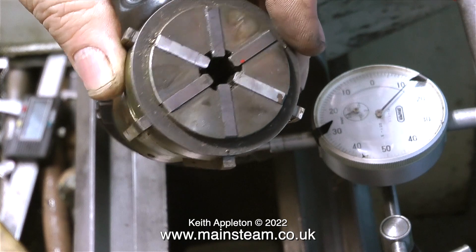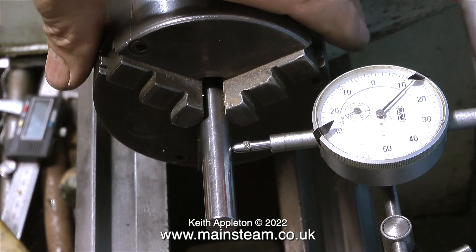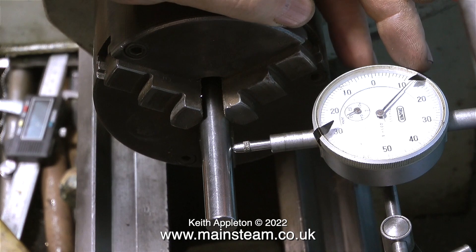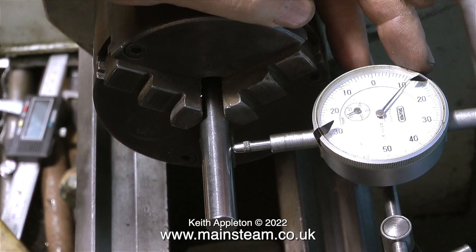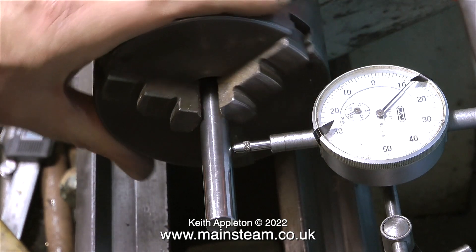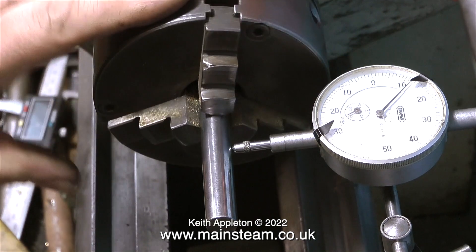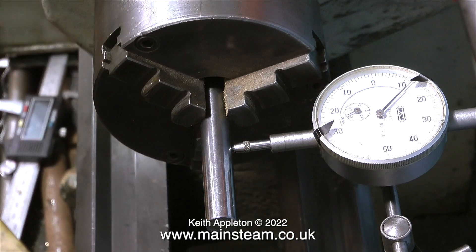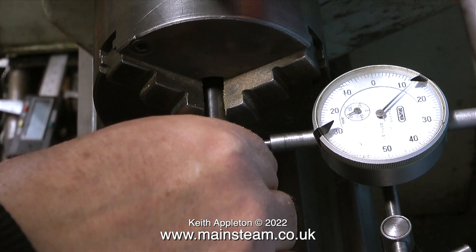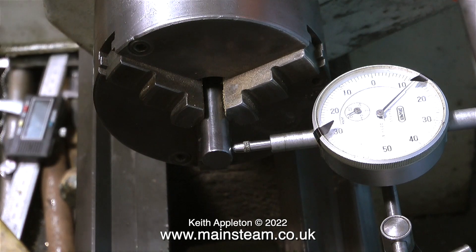This is called a collet — it fits in a special collet chuck. These tutorials are designed for the beginner to the hobby of model engineering, and most beginners don't have a collet chuck. In any case, this is a half-inch diameter piece of bar designed to be turned down to seven-sixteenths, with the end part turned to three-eighths of an inch to suit the crank web. If I want to use the existing diameter as the finished size, it needs to run very accurately so the three-eighths inch part I turn is concentric with the rest.